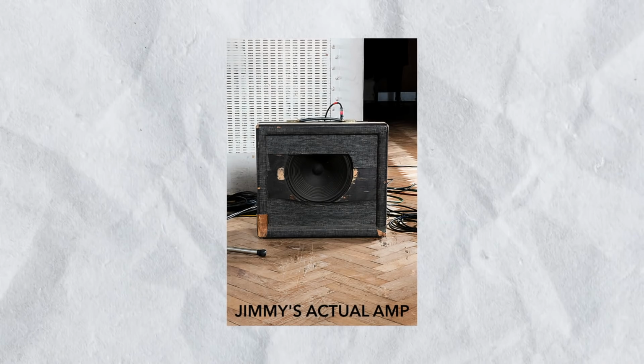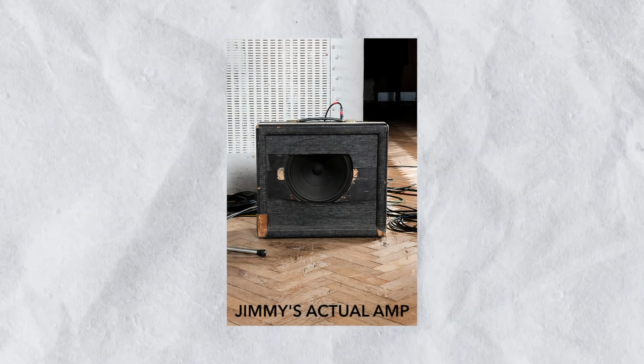Miraculously, the original GE 6L6 power tubes remained, but crucially, those two original 10-inch speakers, more than likely damaged in the fall, were replaced with a single 12-inch Oxford speaker. That's kind of where the confusion around the specs of this amp arises. That, at some point in its life, had been reconed with a Pulsonic cone. The amp was also biased cold, significantly reducing its headroom, meaning that it essentially breaks up at lower volumes.